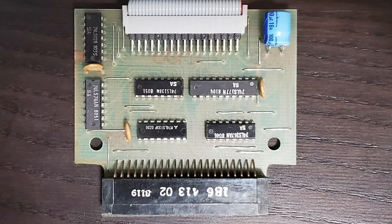So what's inside? Well, it is fairly simple. It just uses some 7400 series parts. Some of these chips decode addresses. Other chips implement three simple registers. One of those registers latches the data being sent to the printer. Only seven bits of data are sent at a time. The other two registers are a status register and a control register. The schematic is provided in the links below.